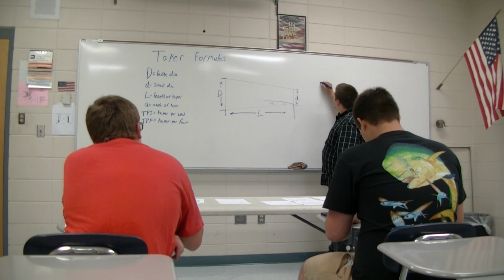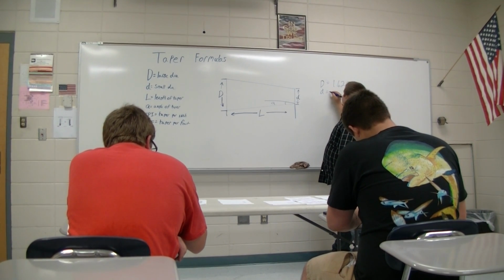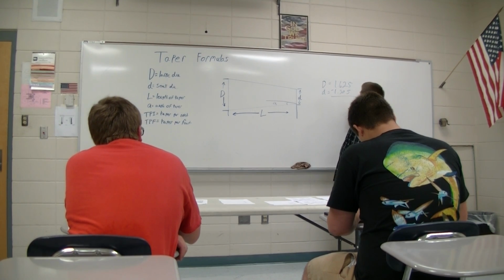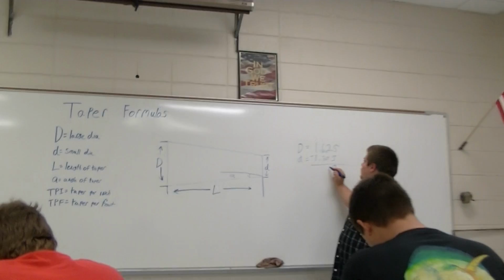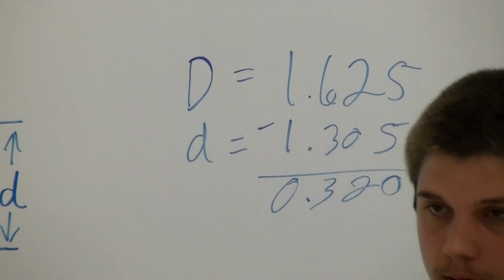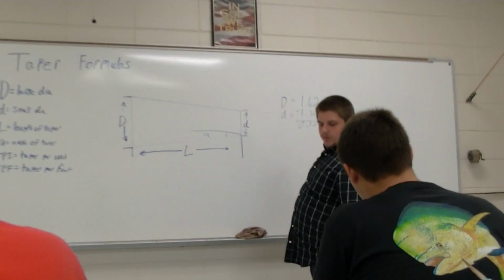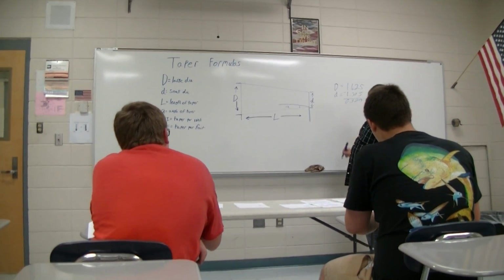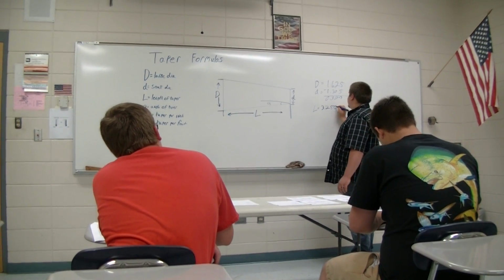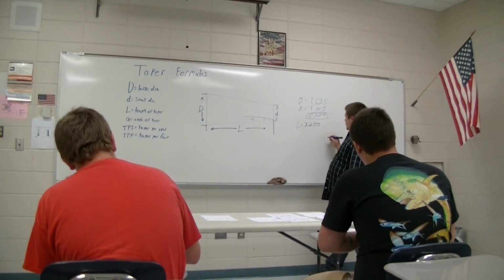So we're going to take our big D, which is equal to 1.625. Then we're going to subtract the little d, which is 1.305. All right? And you come out with 320 thousandths. Is that 1.625 minus 1.305? Yeah, there you go. Now, it gives you the length. L of 3 inches, 250 thousandths. Okay? This number right here, you're going to divide by 3.25. All right?